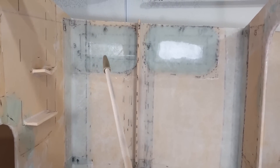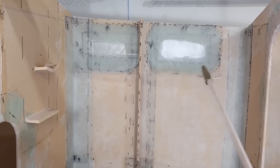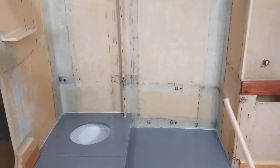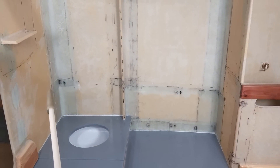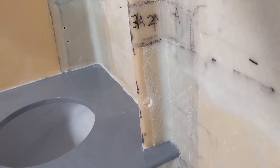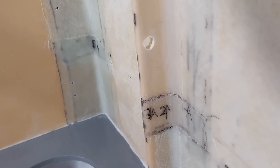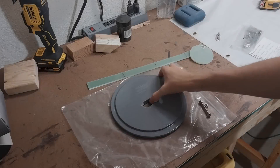Also on the port side here, I quickly showed you in the last video that I've added fiberglass to be the backing for the dead lights on the port side. I've also drilled holes for one, two, three, four, five, six pad eyes so I can secure gear around here. These two big holes are ready to have a pipe section glassed in, and after a lot of thinking, what I decided was to put D-shackles in here for tie-downs. I'll show that install in more detail later in the video.